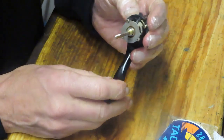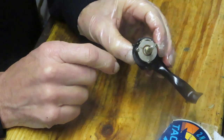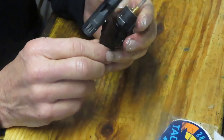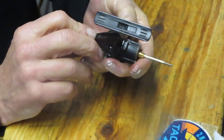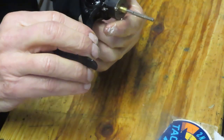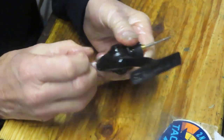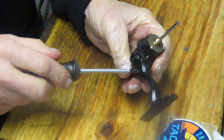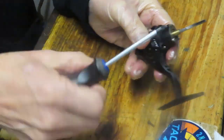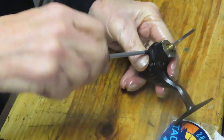Let's get the cover off and then take care of the rest. I want to take the cover off before I remove the pinion gear so I can hold this assembly together. Checking it — it looks like there should be a screw for a bump cap but I'm not seeing it. I don't know what's holding that in. I think it may have broken off. Let's take this screw out — that may release it — and then take the other two out. When you take this side plate off, flip the override to the other side so it won't interfere with removal.